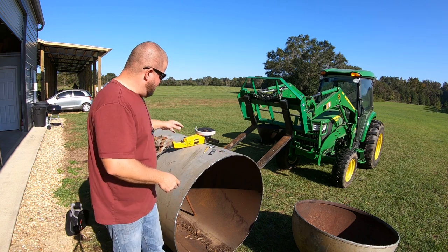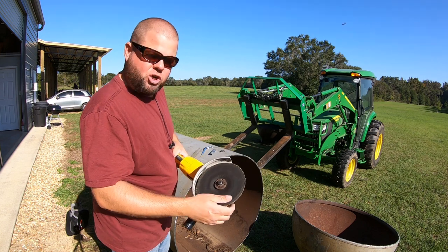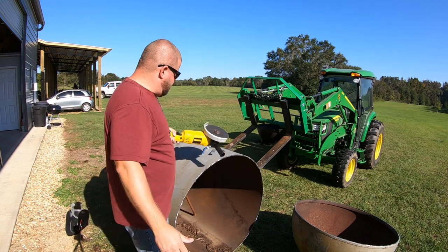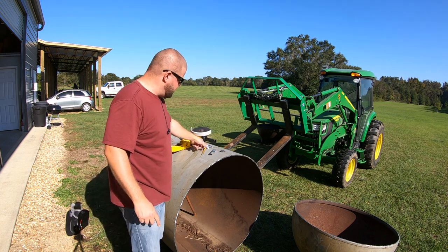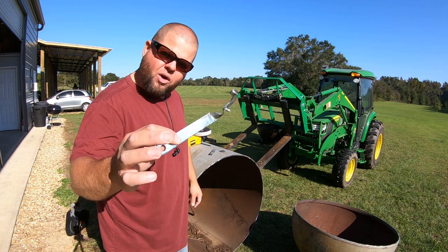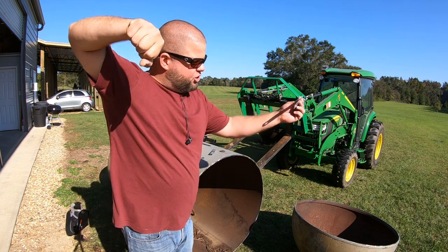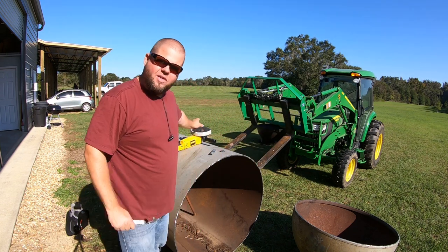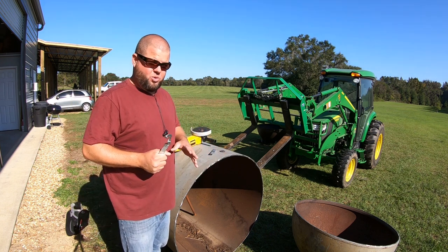The second time, it wedged so bad that it tightened this nut down so tight once this caught and, you know, the arbor kept spinning, that I spent almost 45 minutes to an hour off camera trying to get this nut loose. This little piece of crap flimsy wrench that comes with it, I bent it up so bad. I had a cheater bar on it. I was hitting it with hammers, everything. I could not get this nut to break loose because it had tightened down so tight. Now, I had this happen 2 or 3 times today already.